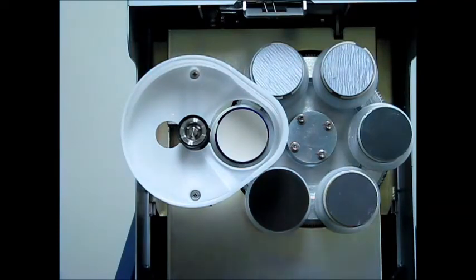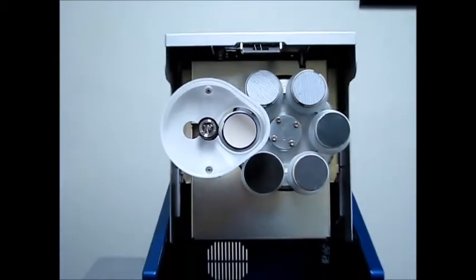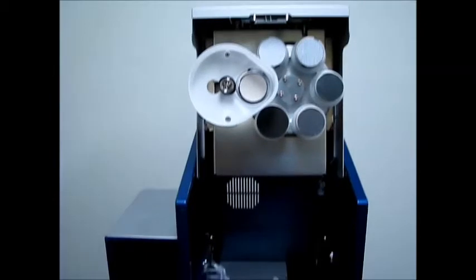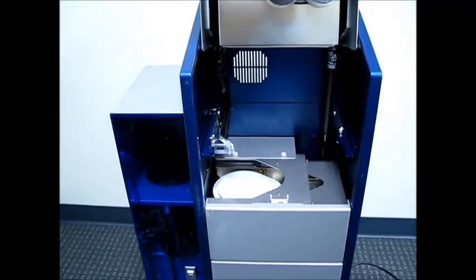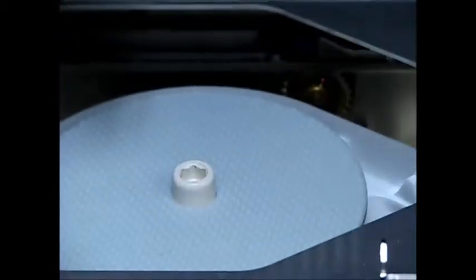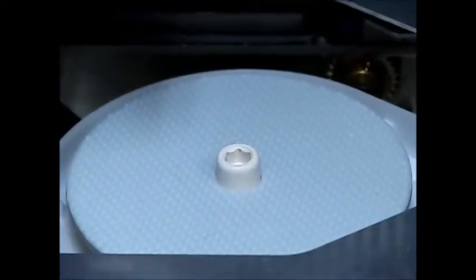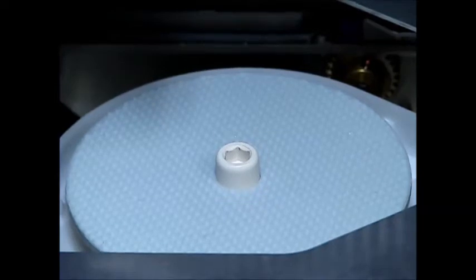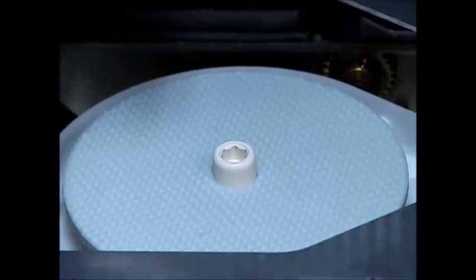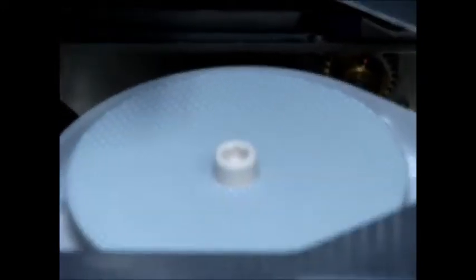Now that we've done that, now let's go over daily cleaning and deeper cleaning. Now, down on the bottom, the white plating table, when this machine is closed up, the sanding pads don't move down to that white table. That white table moves up to the sanding pads. As it moves up, you'll see that under splash cover, which is the same shape as that upper splash cover that surrounds the purple pad holder, as that table moves up, the lower splash cover meets the upper splash cover and forms a clamshell, and that's really where all the dirt happens, I guess we should say.